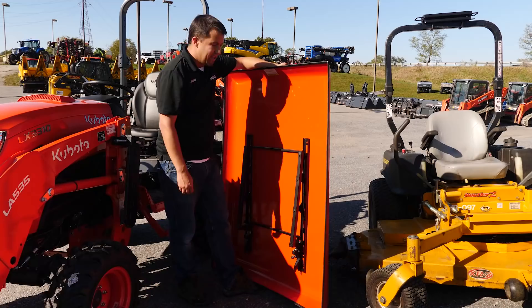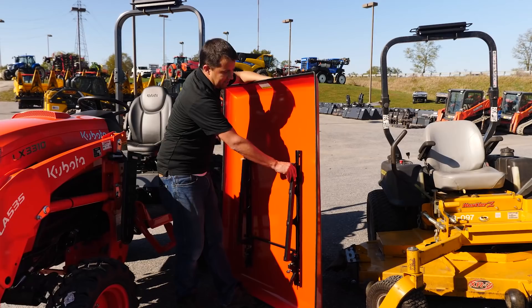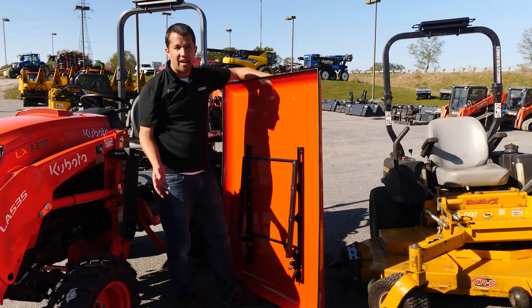The canopy itself is an aluminum canopy with some plastic edging to keep yourself from cutting yourself on the edges. On the bottom is a powder-coated frame that gives it rigidity so you can trailer this thing down the road. It's something you want to watch with canopies — some of them can handle no wind loads at all, while some are good up to a certain road speed. This one is good up to about 35 miles an hour.